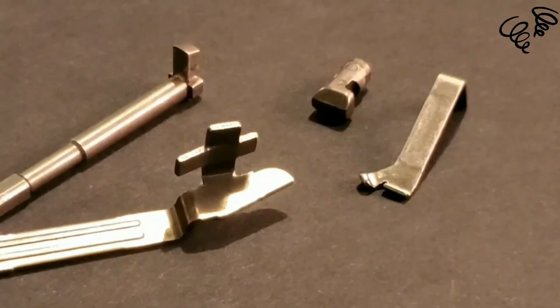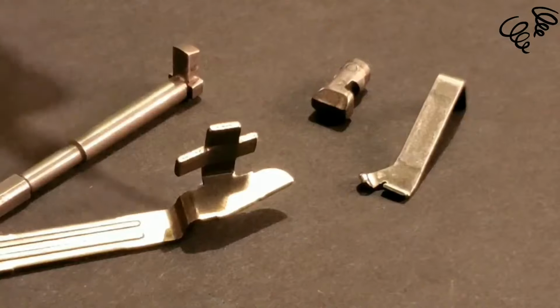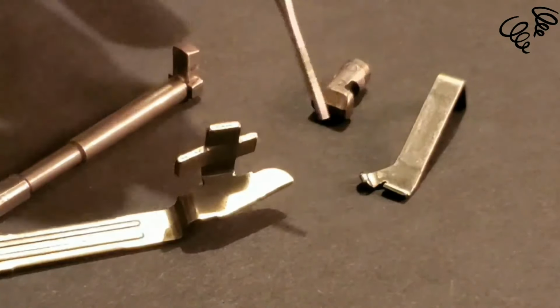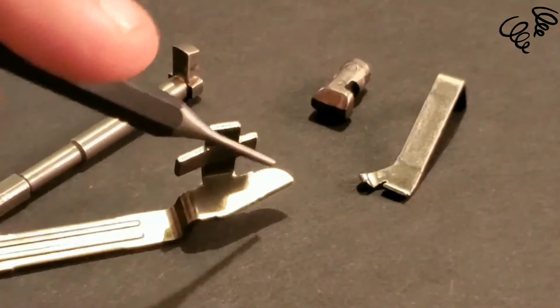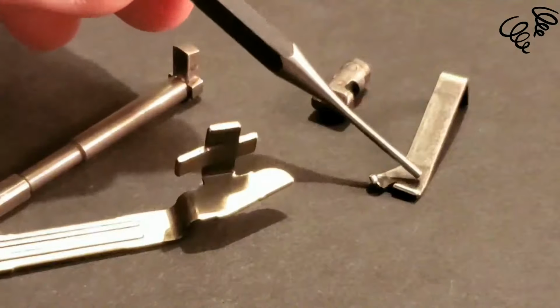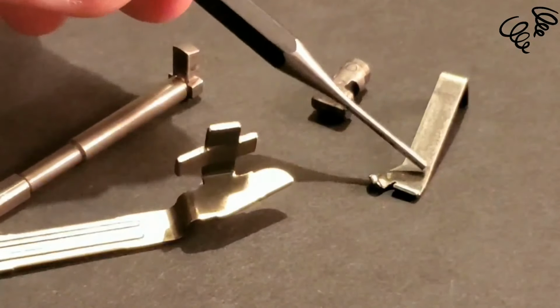The key to a good quality polish job on your trigger housing is knowing where to polish, okay? The main areas you want to polish are going to be the areas that have metal on metal contact, the friction points, okay? So I'm going to point out to you right now, on your trigger connector, this area right here is where the inside of your trigger bar rides along. So this end breaks off of this ledge. Point being, this area right here is a must, okay?